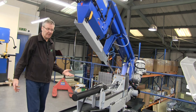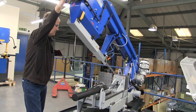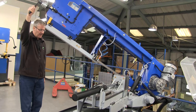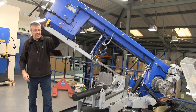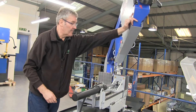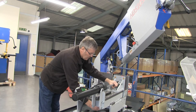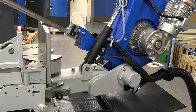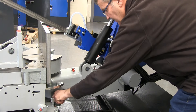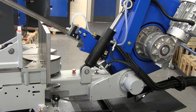Mitering is very simple on this machine — it's 60 degrees each way. You just unclamp with this lever here, pull the machine round to any angle which will be displayed on the screen, and then simply clamp it. If you're going the opposite way, swivel it round, again looking at the screen to see where your mitre angle is, locking it here. All you have to do is unpinch this vice and move it across out of the way. When you've finished mitering and want to do straight cuts, you have an absolute stop here for zero — just lower it down, bring it against the stop and clamp it off, and you're at zero.